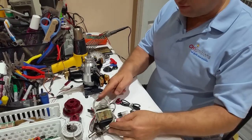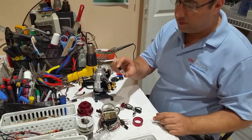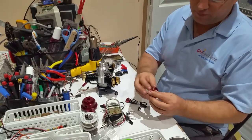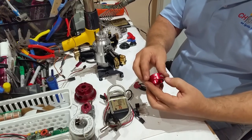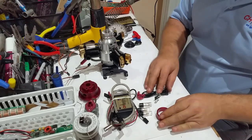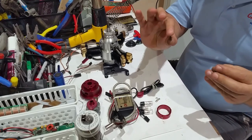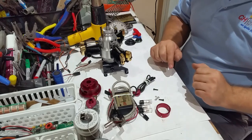A kit will have a 3-cylinder CDI, 3 spark plugs, quarter 32 that they will replace the glow plugs, a magnet ring that's marked with 30 degrees before top dead center, and a sensor holder. And 2 screws and 4 washers. And I'm going to explain the reason for the 4 washers.